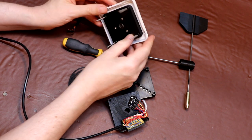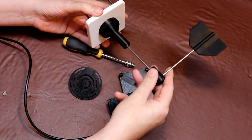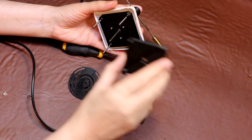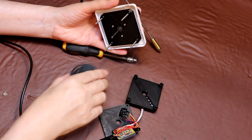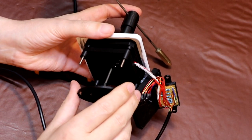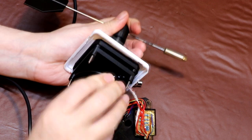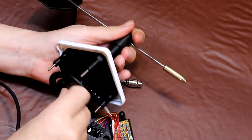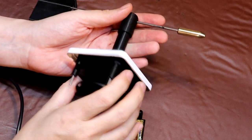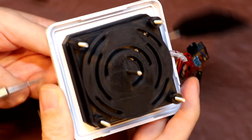So we are now near completion of our weather vane, so let's go ahead and do the final assembly, and then we can give it a test, which hopefully is going to be the exciting bit. Now we really don't have very much to do, we've just got to install these boards which we assembled, and then install our grey code encoder wheel, so let's start doing that now. This is designed to be just a fairly tight push fit. Yep, it is going on nicely. And there you can see that our infrared LEDs are lining up very nicely with the slots in our grey code wheel.